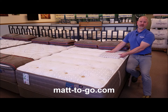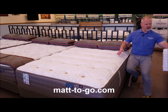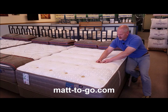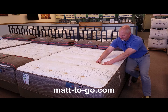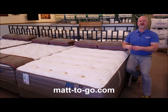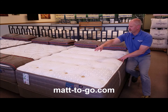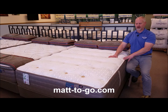Beneath that, we have a one inch thick piece of high performance polyurethane foam, and that's all the comfort layers within this mattress. You may have noticed these little brown yarn rosettes all around the mattress — these are tufts. This mattress is tufted by hand. Back in the day we used to have metal buttons, but these are yarn rosettes with a plastic button on the inside, so they're less obtrusive. Tufting a mattress is the single best thing we can do to increase the life of the polyurethane foam. By pre-compressing it and putting these tufts in, it helps reduce the artificial loft of the foam and minimizes foam travel side to side. This is all tufted by hand at the factory, and that's something you should expect from a higher end premium or ultra premium style of mattress.